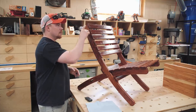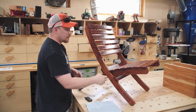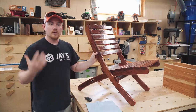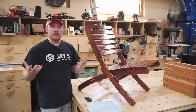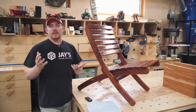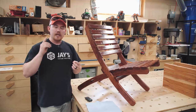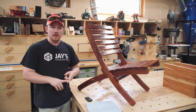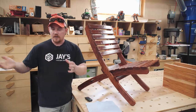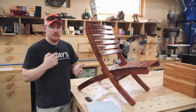The template itself has a bunch of cleats built into it for every location where there is a slat. So you simply attach the template to your workpiece, whatever material you want to make the chair out of, and you transfer that template shape to the material with a flush trim bit at the router table or a handheld router. That gives you a perfect, precise, one-to-one copy, and it is extremely repeatable. You just pop the template off, put it on another one, and you're good to go again — you can make as many as you want.